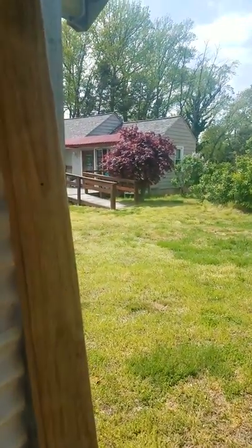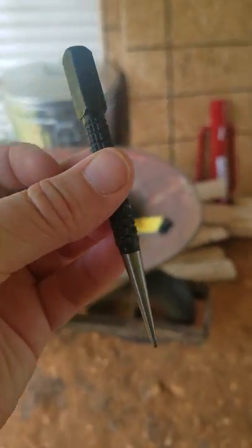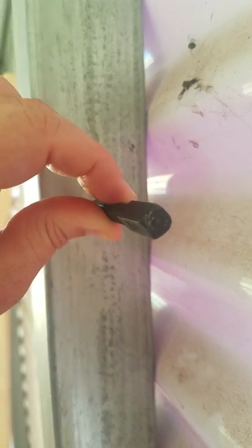So I'm clamping those boards and drilling the holes. Tomorrow I'll clamp them back on and be able to just screw it in super easy. What happens is it makes a little mark, and then I take that and drill through with the bit. After I use this guy right here — the center punch. You can see this one is in process right now, with that little kind of hole there. I just put the center punch on here and smack it with the hammer, and it makes that indent in the metal, then I go ahead and drill it.